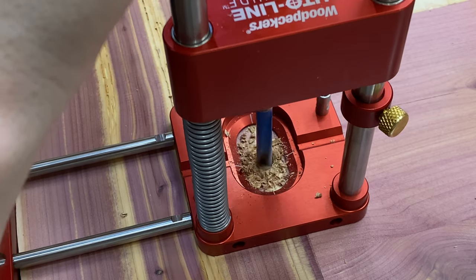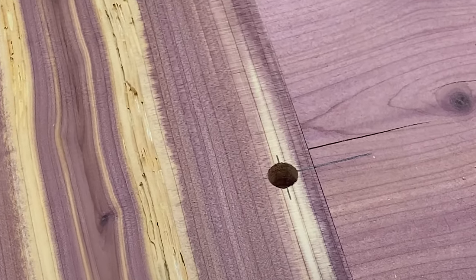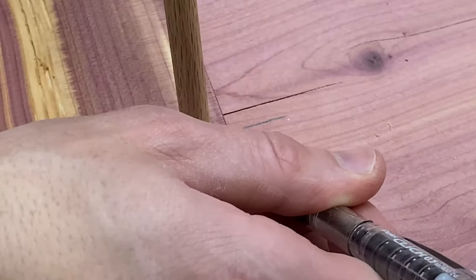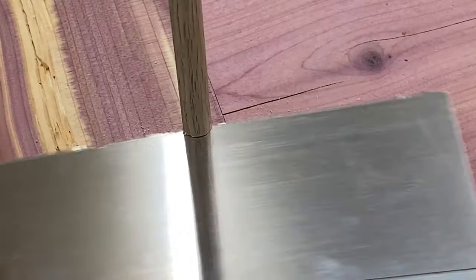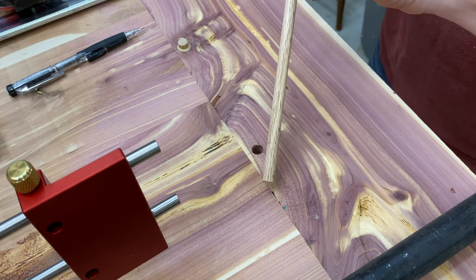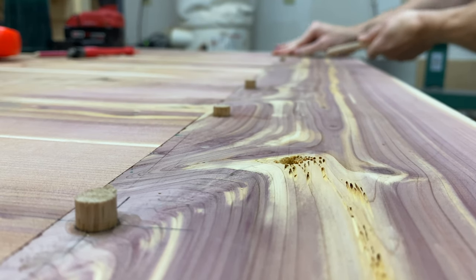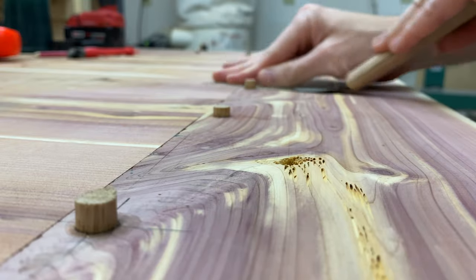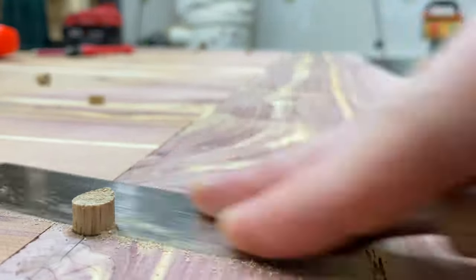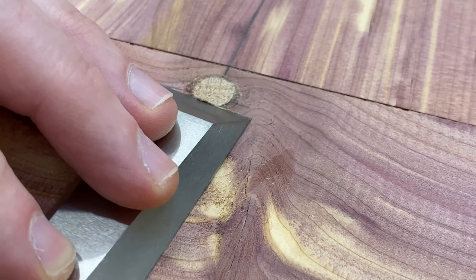To help add stability to the breadboard, I'll add a dowel into the dominoes on the breadboard side. I've drilled the holes using a bit just slightly larger so there is some space down inside the domino within the breadboard to allow the dowel and the domino to move slightly. I only apply glue to the top portion of the dowel — the bottom portion will insert below the breadboard and into the domino. The domino will flex and move, and this is where I decided to apply my risk. If you feel more comfortable making a larger hole and applying your risk toward the lack of breadboard stability, go ahead and pull the breadboard back off and enlarge the hole in the domino. With that, the breadboards were attached — now let's watch some nice chiseling action on those dowels.